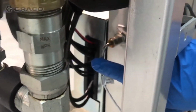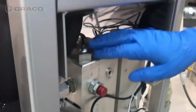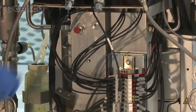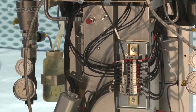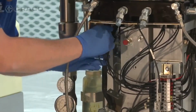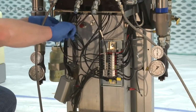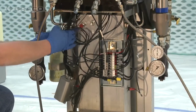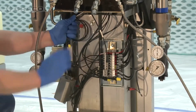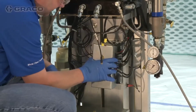Find the corresponding heater rods that share the heater block ports with the A and B side RTD. Disconnect all heater rod wire pairs except for the identified rods nearest the RTD for both A and B heaters. Install the twist-on wire connectors onto each disconnected heater rod wire pair. Secure the wire pairs with the provided cable ties. Reinstall the protective shroud.